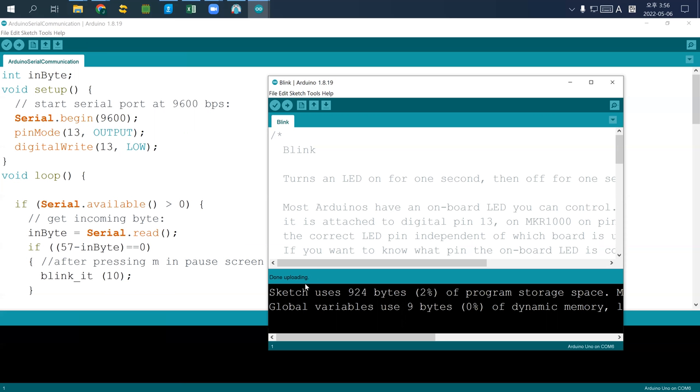And finally, we have to check this microcontroller is healthy. Then you probably see that there is a built-in LED, yellow or orange one, which blinks 1 second on and 1 second off. So if you have this blinking LED, this simply means that your Arduino is healthy and everything is healthy. So you have to check these three things: power, USB connector, and your microcontroller. Then I strongly recommend that you continue to the next step.